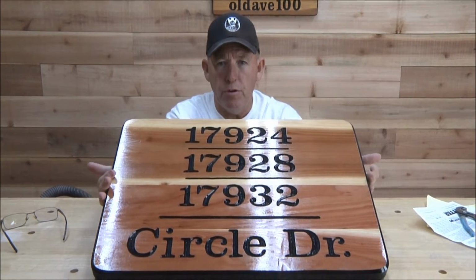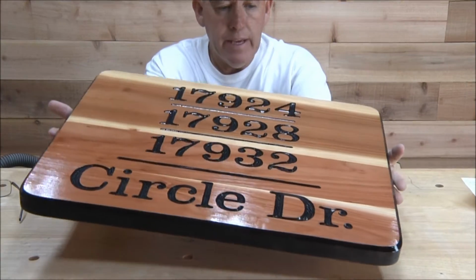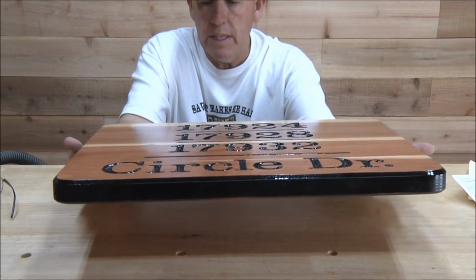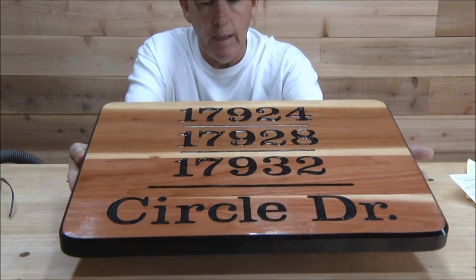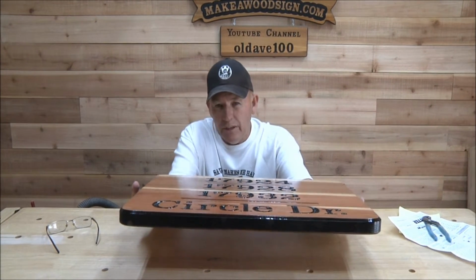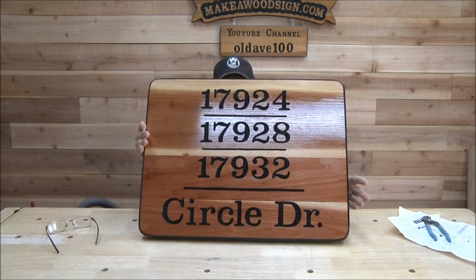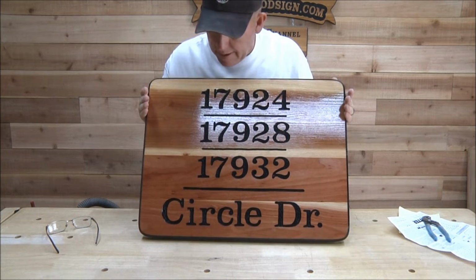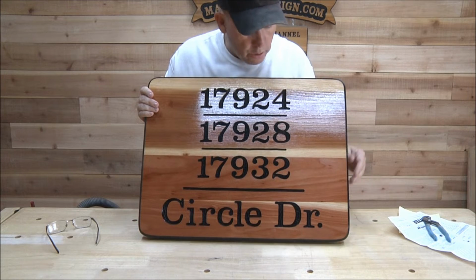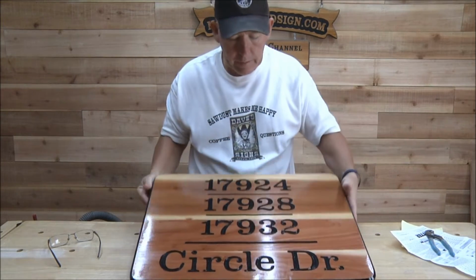We'll be right back. So here's that sign that I did on Friday, and I've got 3 coats. I put the 3rd coat on this morning, a couple hours ago, and actually I put it on fairly heavy. I may put one more coat on this thing. I don't know, but man, I love the way this thing is spraying. And I haven't done any adjustments to the nozzle. I'm spraying it at about 50 psi, straight up, and I could put one more coat on there. I might, but it would be plenty good just the way it is. Really does a nice job.